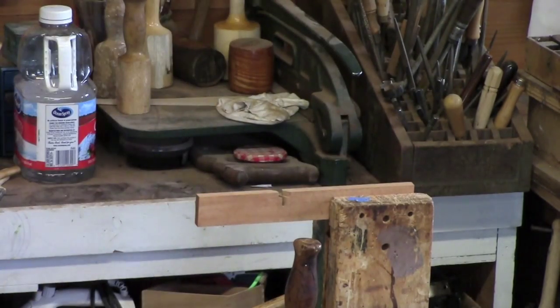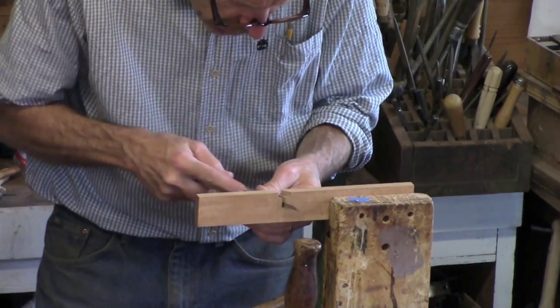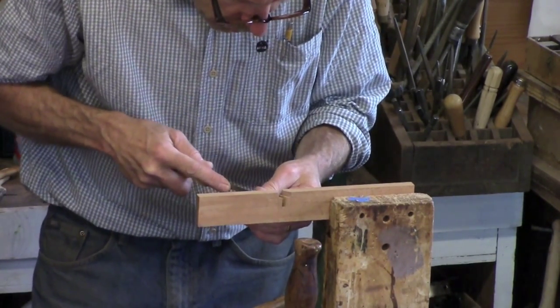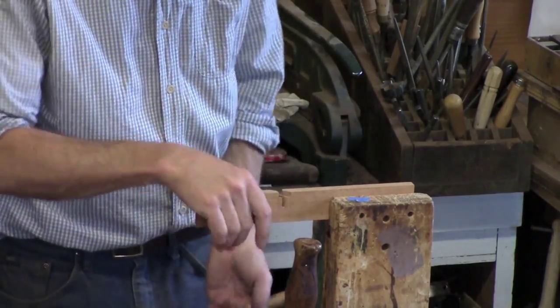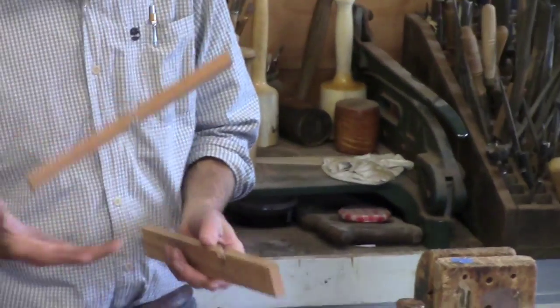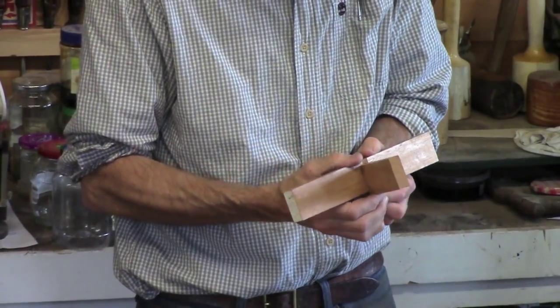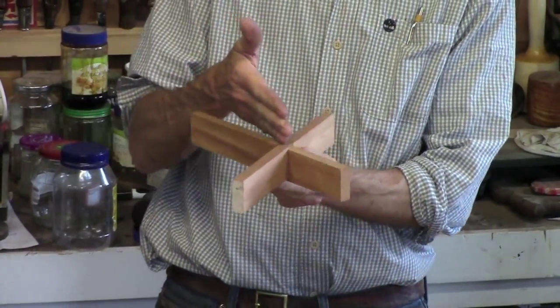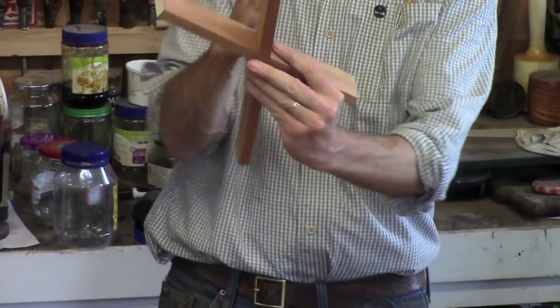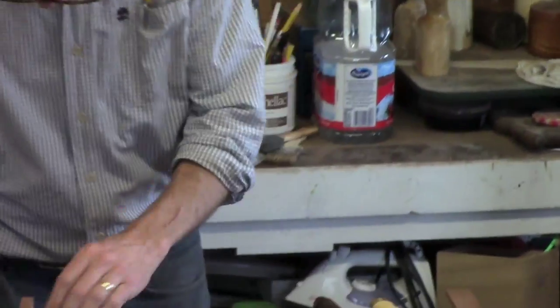Is this clamp when you're fitting it so you check it against your plywood? Yes, absolutely. Check it against your plywood, your layout. Sometimes when you do this, if one of these angles is a little off, it'll change your X a little bit one way or the other, and you want to check it against your drawing.